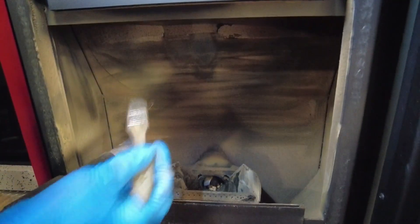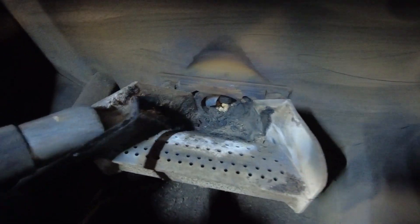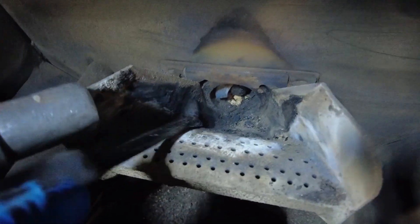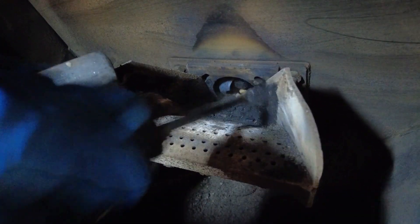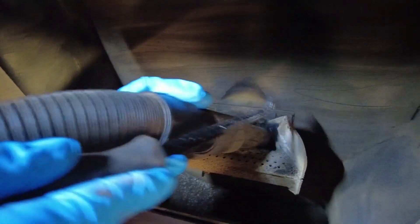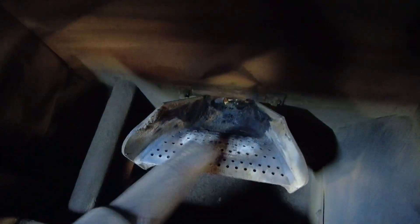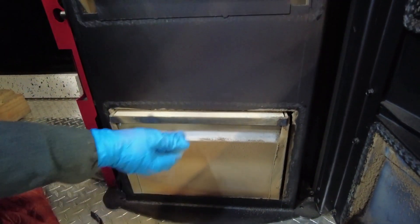She's going to the sides and the top while the vacuum runs the whole time. One of our tools is a flat screwdriver turned on the end at an angle — that's used to scrape the carbon off the burn pot, where a lot of carbon builds up. She's tapping some of that down to get it into the holes. You want to scrape this really thoroughly. You can also do this when the stove is warm after it's just gone out, or even while it's burning — Harman does recommend that for light scrapes. Now we're moving on to the ash pan.